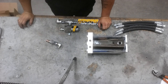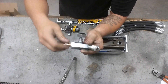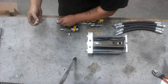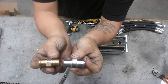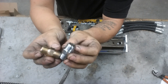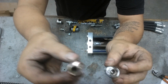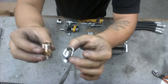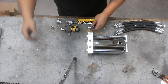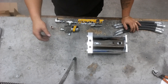Then you're going to have your slowdown. Your slowdown is going to be 3/8 pipe on both sides — pipe, pipe. This one and the check valve look identical minus the color. But the difference is going to be the inside: on the slowdown you can see right through it, while the check valve has that check ball inside. So make sure you guys don't get these mixed up. This video is based on basic guys learning how to assemble the pump.